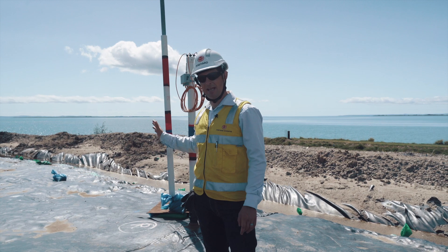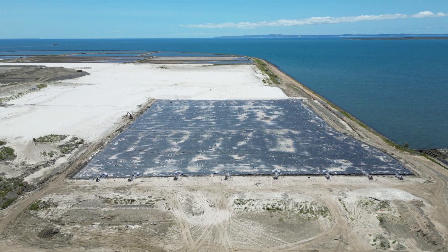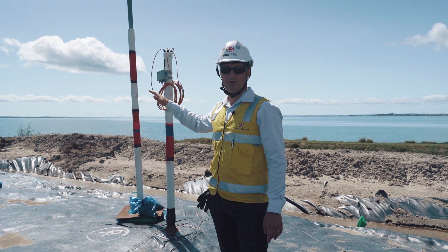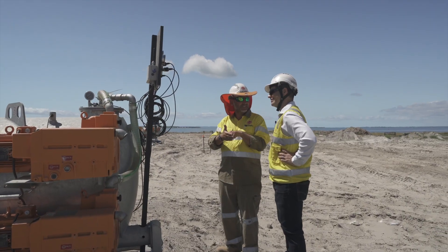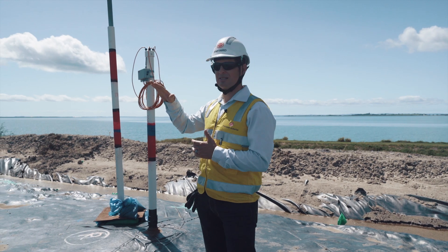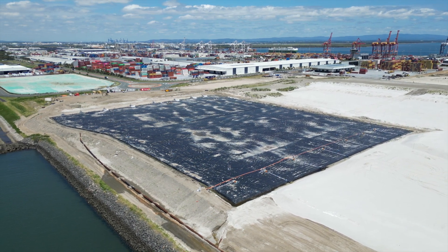As we approach the outer perimeter of the project, we approach the coastal infrastructure of the port. What's important for this port is that we don't damage or impact on this coastal infrastructure. That's the key reason why vacuum consolidation was chosen for this project — really the fact that we couldn't preload four metres high because there is a stability issue. As you increase that preloading, you need to have a stability berm, and as you can see, there's no space for a stability berm.